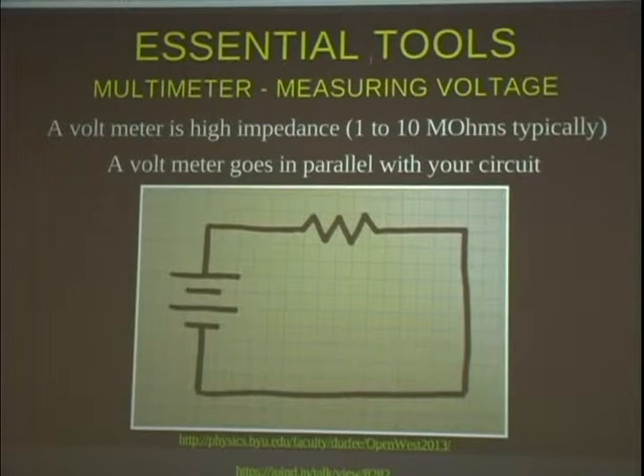Let me talk about voltage and current. Voltage is like pressure: if you have a water pipe and want water to flow through it, you need a higher pressure on one side than the other. Voltage — also called potential — is like that pressure, and current is the actual flow of charge. Only voltage difference matters; absolute voltages don't. A battery's job is to maintain a constant voltage difference — if it's a 9-volt battery, whatever the voltage is on one side, the other side will be 9 volts higher. Wires, being conductors, have the same voltage everywhere along them.